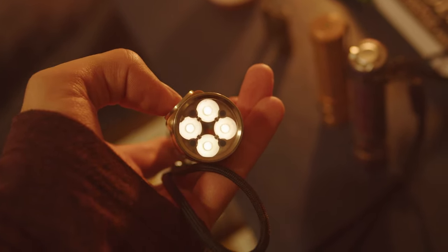Functionally speaking, I think the SST20s with the clear optic are the best all around, with a great general purpose beam and excellent color, though the Nichia option gets more use from me as it's so unique and fun — the warm color is very nice for usage late at night as it's much gentler on the eyes. One final note: I believe the color of the pill will have an effect on the beam color, as the TIR optics allow light from the LEDs to bounce off the surrounding material. The titanium model is noticeably redder, and I suspect the copper pill is responsible for the rosier tint. I would recommend purchasing the black model if you don't want the beam color affected at all.